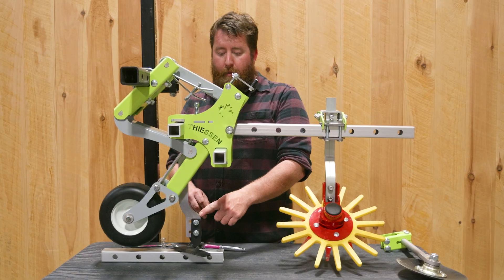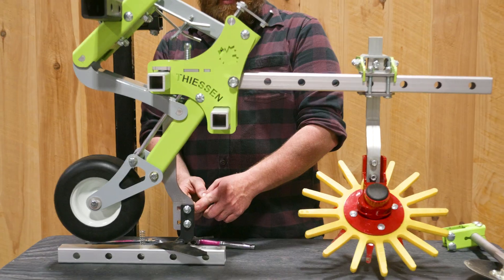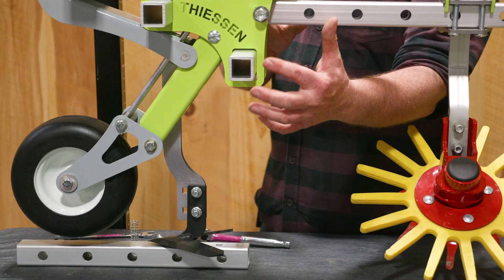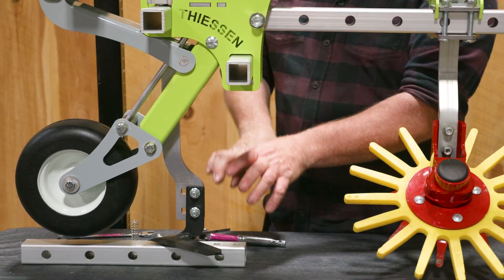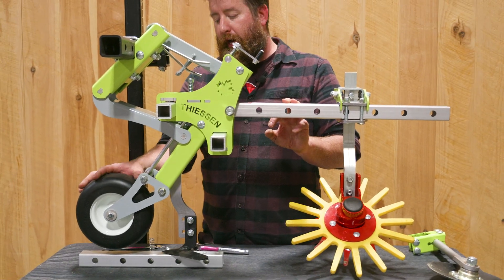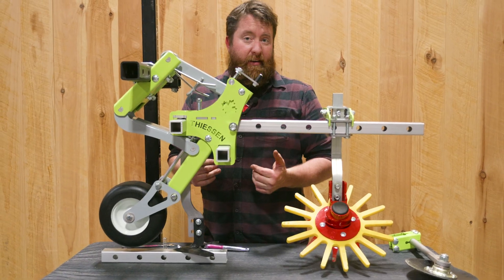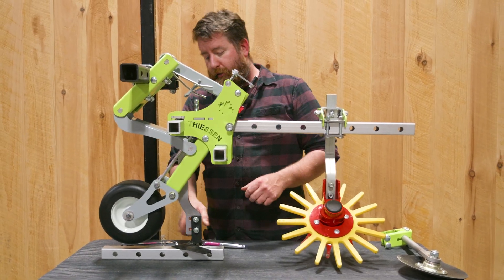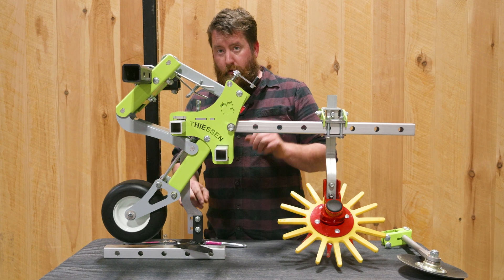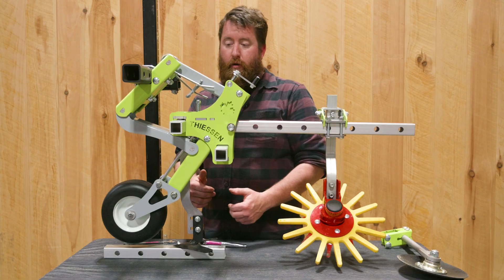You'll see here I have the A-blade bolted into the back set of holes on this offset shank. That'll normally be the place you'll attach the A-blades unless you have other tooling on the back that's going to interfere with it. You want adequate space between the tip of the A-blade and the gauge wheel to prevent trash from building up and catching. If you have pretty clean fields and you need the room, there's no reason not to move the A-blade closer to the tire. Also to note: the larger A-blades stick further ahead from the bolts than the smaller ones do.